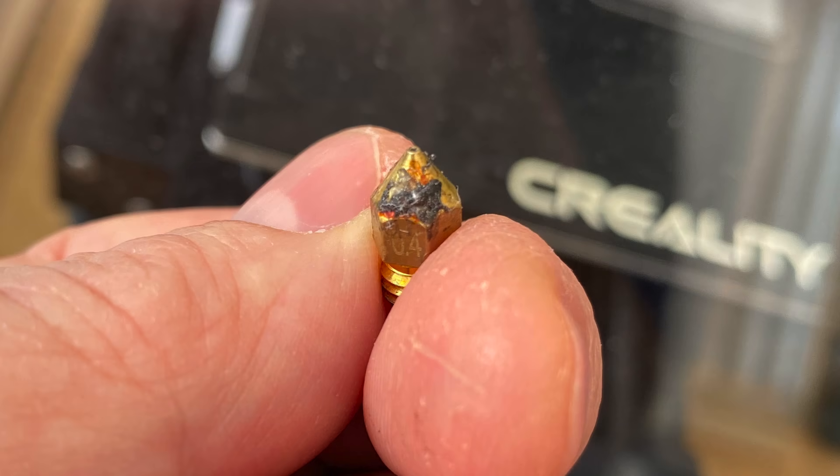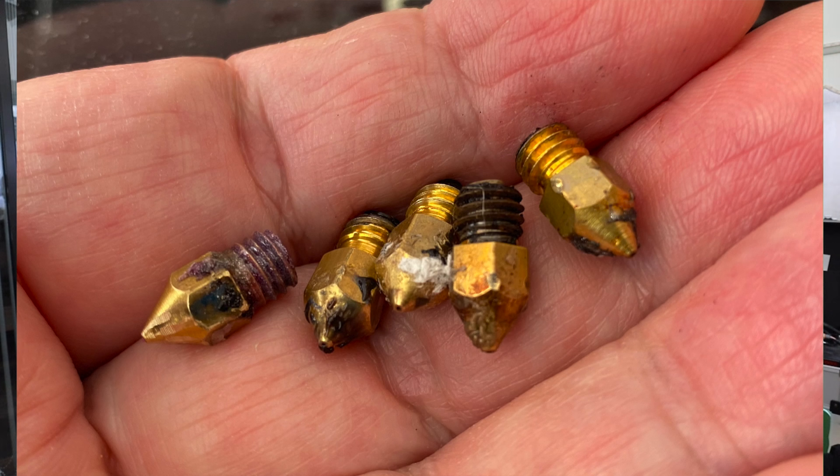And a bag of nozzles. What I've found is that when nozzles start to get blocked and troublesome, the filament starts sticking to them, dragging little tails off and making a mess, and the first layer struggles to go down. Bang a new nozzle in there and you're good to go. The PTFE tube in the hotend: the nozzle and the PTFE tube should be a good mate. You've got to cut the tube perfectly at 90 degrees — follow the instructions and make sure the tube is all the way home.